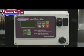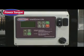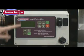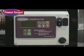We have found two sporadic issues with the JCB engine. On the 24V variant, there is a design delay — when the key is switched off, the display stays lit for about five seconds before it switches off. We've also seen a warning for charge fail during cranking conditions, due to the heavy drain on the starter motor. This normally indicates a suspect battery reserve voltage. It's not an issue to be concerned with; if it appears when the engine starts, just hit fault reset and it'll disappear. The alternator is charging and the battery is obviously good enough to start it, so there's no real concern.